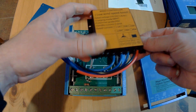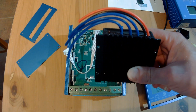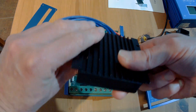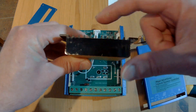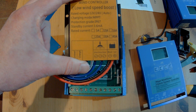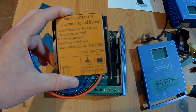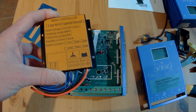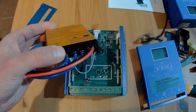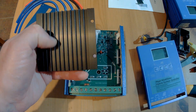The second controller is completely glued, so you cannot really open it. There is a YouTube video showing the inside components, which I will paste in the description below. This is definitely a low wind boost controller — not a real MPPT. After the low wind boost, it is just a rectifier with some pre-programmed voltage controls. The heatsink is not very large.